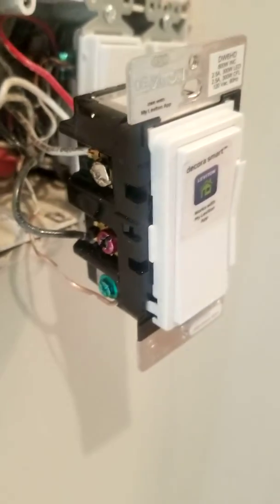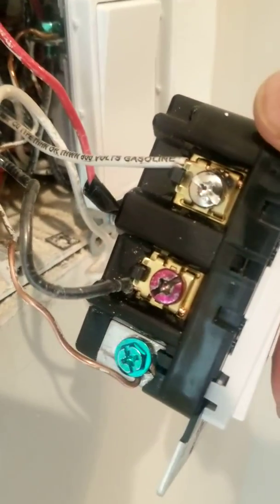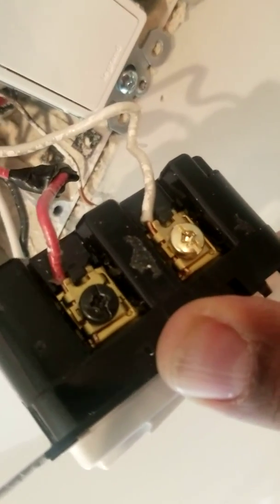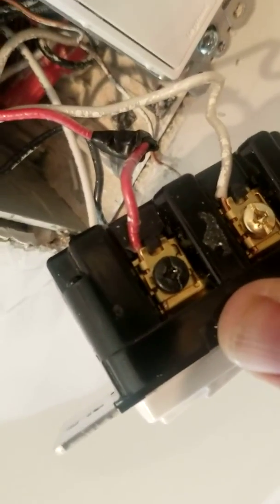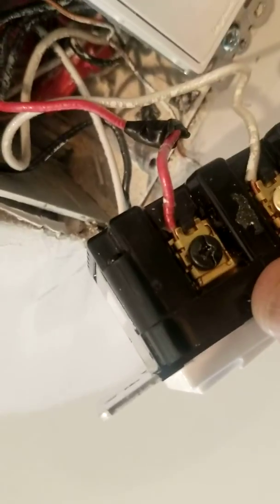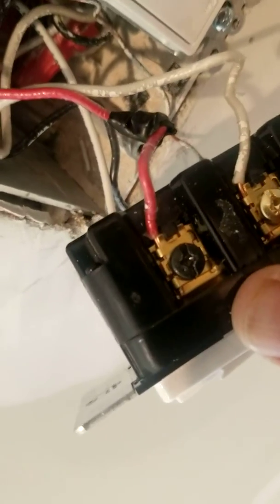Always test before you put these wires back in. Keyword summary: on the master switch, put your load wire on the red terminal because that's what takes the command on and off. The first traveler wire makes sure it goes to the same port on the remote — that's the YL-RD. The first traveler wire coming from the line-in box where the remote goes: that red wire goes onto the BK. That's my second traveler wire going to the BK, carrying the hot signal, my line-in.